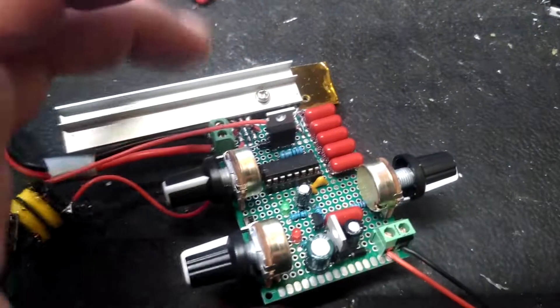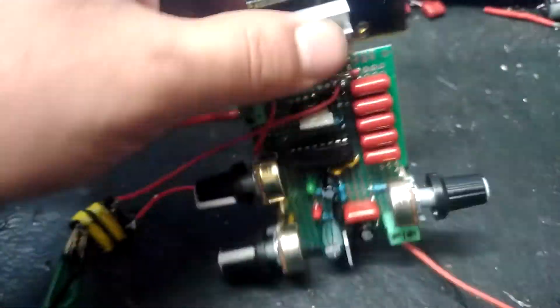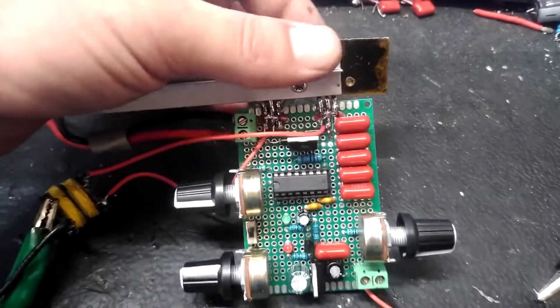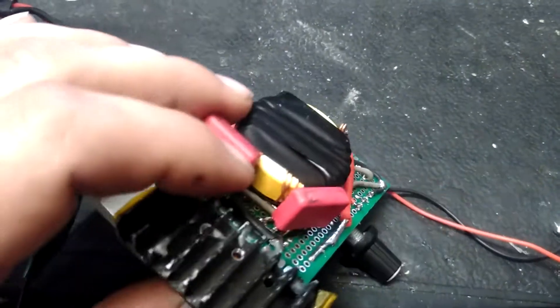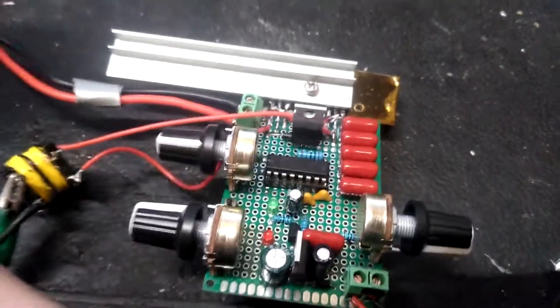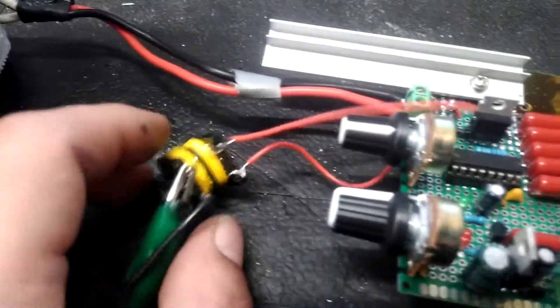This one I built — the whole point was to make sort of another mini coil, so I wanted to make the board a little smaller. There are always some slight differences when I throw one of these together even if they're pretty much the same circuit. I've got a common choke setup here, a 1k pot — that's just what I had — but basically the same setup using those MOSFETs with this coil right here.